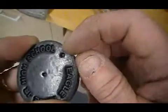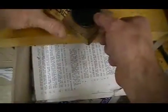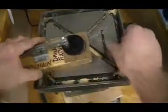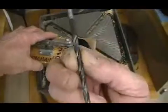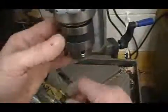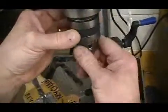Now the hole we're going to drill in the plastic keychain is at the top of the keychain, not the center. Place your keychain underneath the clamp and push down on the lever. That'll lock the plastic keychain in place so we can drill. Find a 3/16 inch diameter drill bit from the drill index in the tool cupboard. Place the drill bit in the chuck of the drill press.